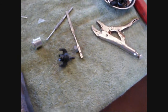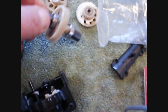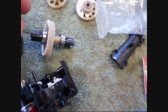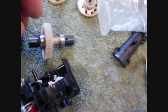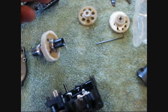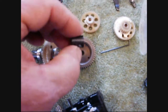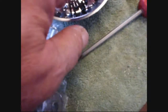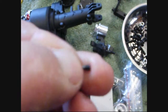So I can reassemble that and put that to the side — three more of them. The next thing to do is take a tiny Allen wrench — just the one that fits — and take these things out. These get loose and they shatter, and when they shatter a little piece goes into your gear case and cheeses stuff up. Before any hardened pins can go into these drive cups, you've got to do the changeover to the steel gear.